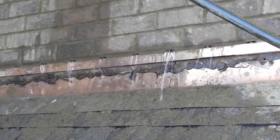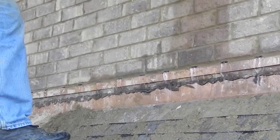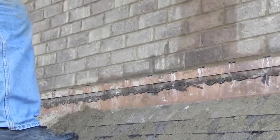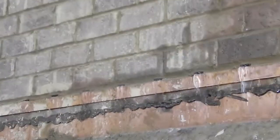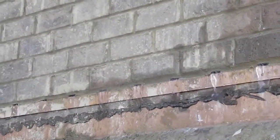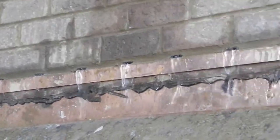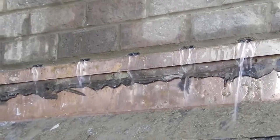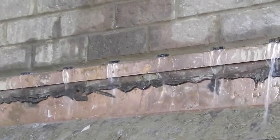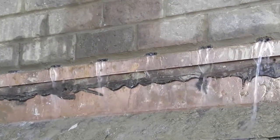As the flashing emptied quickly after the input was stopped, the function of each weep changed to venting. It is known that positioning vents at the bottom of a wall is the best way to dry a wall. Furthermore, drying a wall quickly reduces the likelihood of staining and mold growth. During the test, the owner of the property was stationed in the interior of the building to watch for leaks. None were observed. The problem of water leaking into the interior space was corrected.